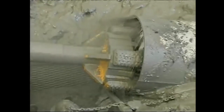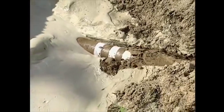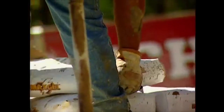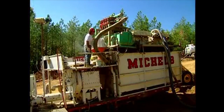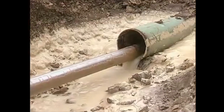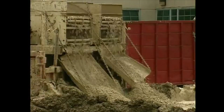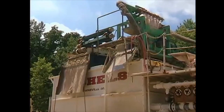During the drilling process, we use a drilling medium called bentonite, an environmentally safe, organic, powdered clay. The clay is mixed with water, pumped through the drill stem, and injected ahead of the pilot bit to help clear the way, provide lubrication, and carry material back to the mud rig. Our fluid maintenance equipment cleans and recycles the drilling fluid.